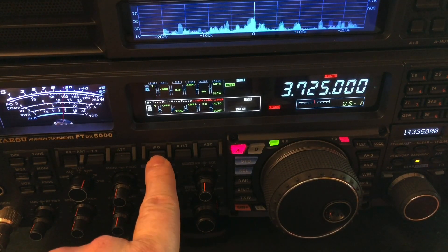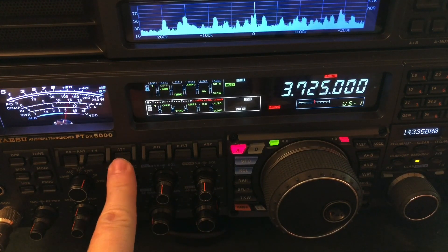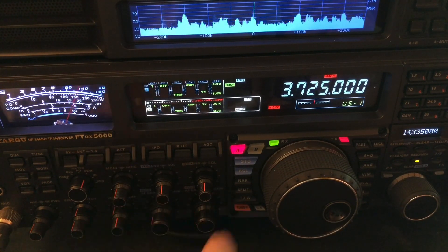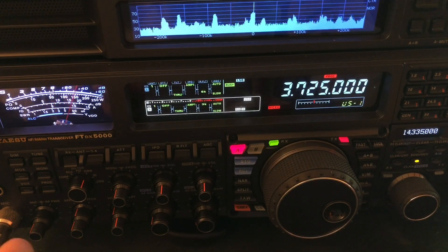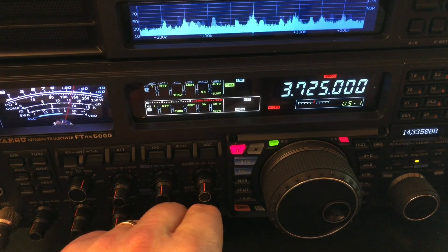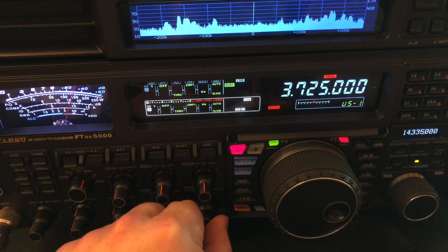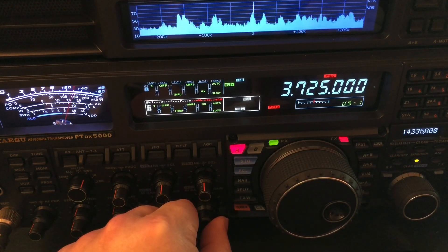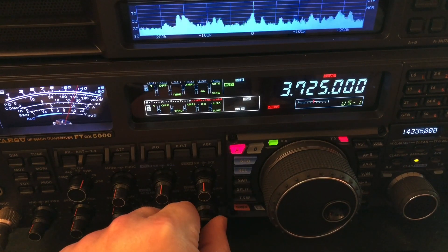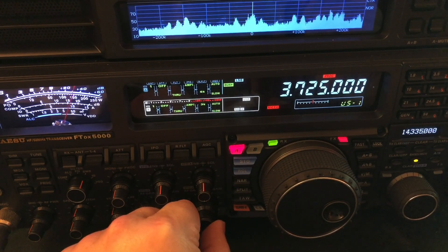Why would you do that? Well, normally if you're on amp one, let's take a listen on the band. You see how strong that signal is? Look at the scope — there's a lot of noise on these lower frequencies. This is 80 meters. When you get down to 40 meters or lower — 40, 60, 80, 160 — you're going to have a lot of QRN, just noise. But with a signal that's 30 to 40 over S9, I don't need to be listening to S7, S8, S9 of noise. That's S8 of noise, right?